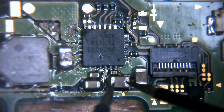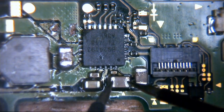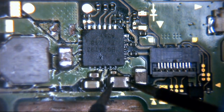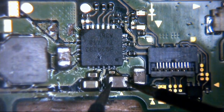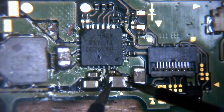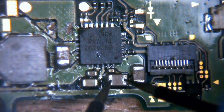So what happens here is we have multimeter probes on both sides of the capacitor. The multimeter at the moment is reading open line, OL. Multimeters will show that as a 1. Essentially, it's infinite resistance. It basically means there is absolutely no interaction across that capacitor. Now, that in continuity mode is perfectly acceptable. That's what we'd expect. We wouldn't expect there to be any measurable resistance on there. It should be OL open line, and it is. Sometimes you'll see the count on your multimeter going up, because it's taken a charge from the leads on the multimeter. But essentially speaking, there shouldn't be any resistance measured across there. It should just say OL open line.